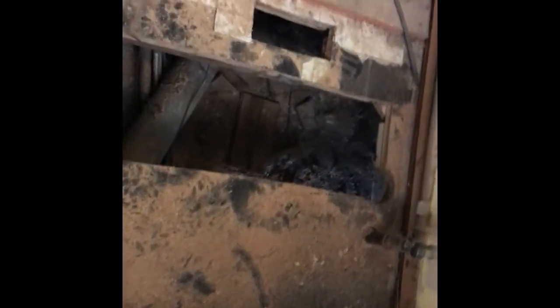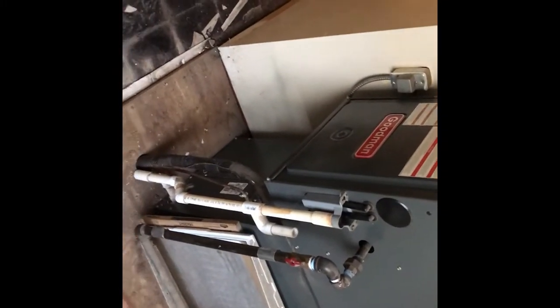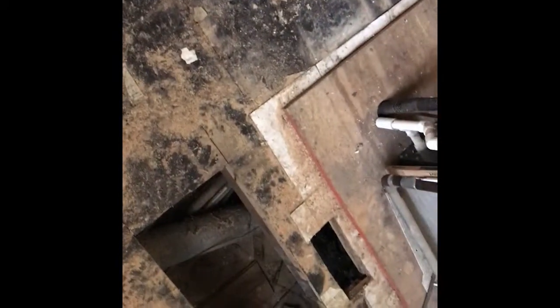This will all be replaced with three-quarter inch pine or plywood. I will have issues over at the edge of the house because the joists go this direction — I can't cut the subfloor mid-joist. So I'll have to stop where the first joist starts so we have a solid subfloor from that joist to the exterior sill. But I'll be able to get most of it out, and once this furnace is moved, get everything leveled, joists properly supported and fixed, with new joists added as needed.